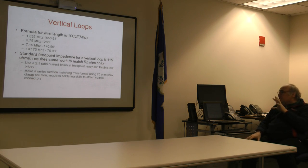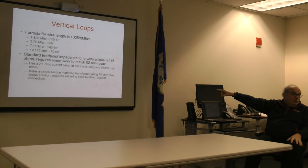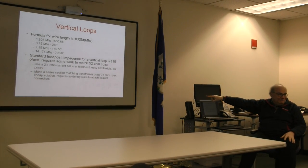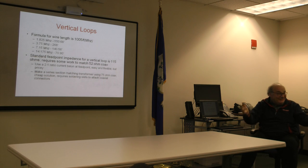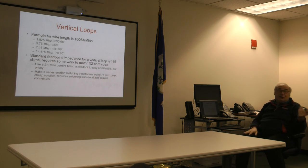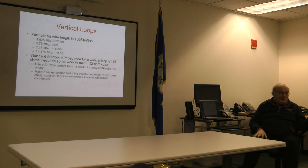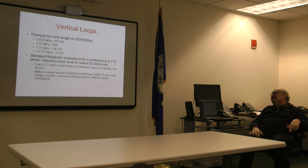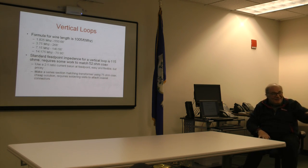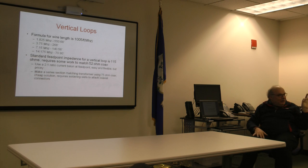There's a couple of relatively easy solutions for the matching, and it just depends on your attitude. For years and years, I used a matching network made of 75 ohm coax. What happened was this year when I went to get back on the air, I had just gotten a brand new 2 kilowatt linear, number one, and the RG59 that the matching network was made out of was disintegrating in my hands when I went to inspect it at the end of last season. I was in a hurry, and I hadn't asked the wife for my Christmas present yet. It was 5 days before Christmas, and I'm like, the hell, I'm not doing another soldering job with that crappy RG59. Dear, I would like a 2-to-1 Balun. I'll just order it, and I'll show you the credit card slip, and I did. So I'll show you a picture of the Balun. That's the easy way to go.